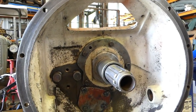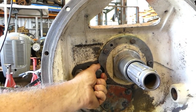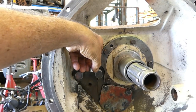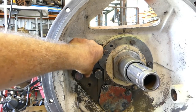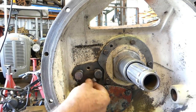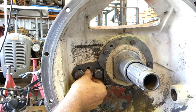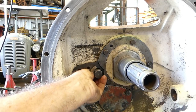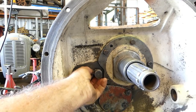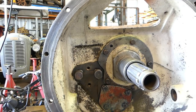Okay, it's a little bit dark there. Yep, this is the front of the two shafts that come down. They have a little lockout that sits in between them. With the lockout sitting here like this, it pops across one way, so you can only ever shift one gear at a time. So now's the time to pop that in. That just sits on this housing here, and we've got a little bit of sealant on the housing, and this just needs to sit in there like that, which can be a bit of a nuisance to get in there, I tell you.